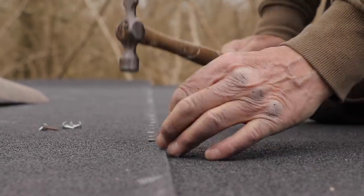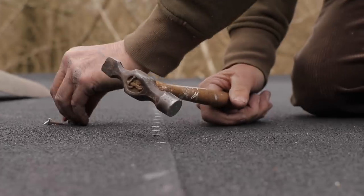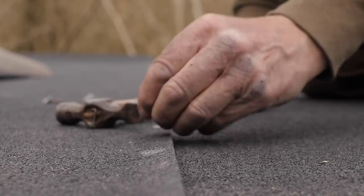It made sense to just go with the OSB. That's 11 mil, I want to say. Again, we could have gone more hardcore and gone 13, but 11 was fine. We don't want loads of weight up there. So 11 mil OSB board, felt on top, keeping it really simple. Remember, we're not living in this. It's not a long-term thing. It's just for storage and for being able to look out that way at nature and get some good photographs and videos for you guys.